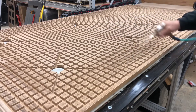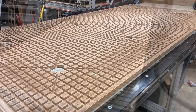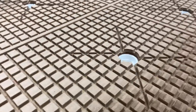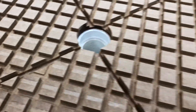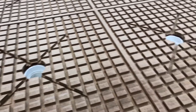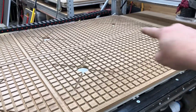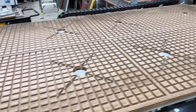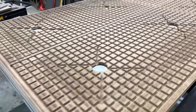Just be sure that the plenum board is really clean before the next step — blow out the pipes and blow out all the channels in the board. I added diagonal raceways across the other raceways because that's the point of entry for all the vacuum, and I wanted to allow for increased air flow across the board. The channels also help partition off each of the zones when they get turned on and off.